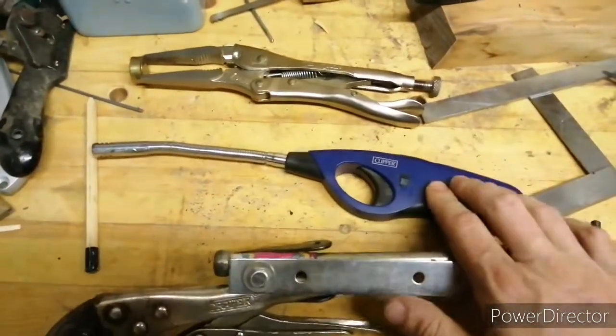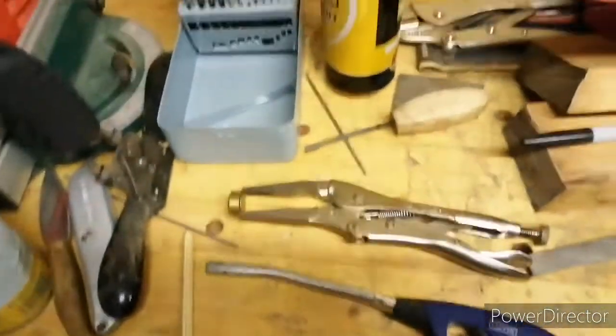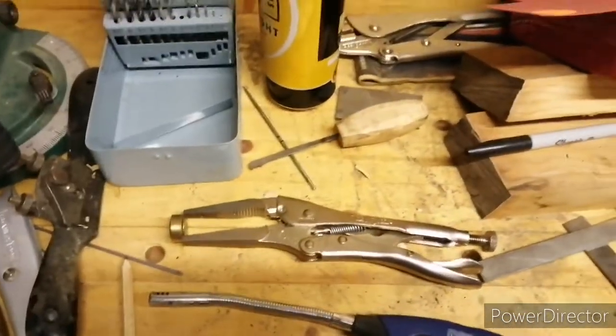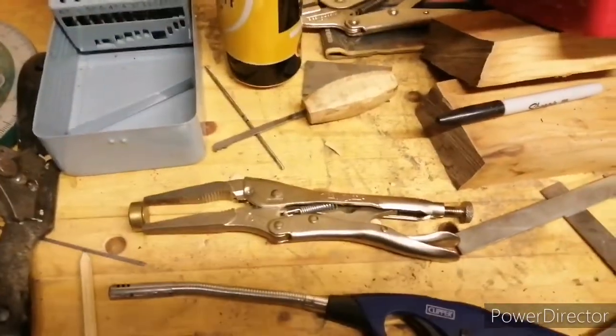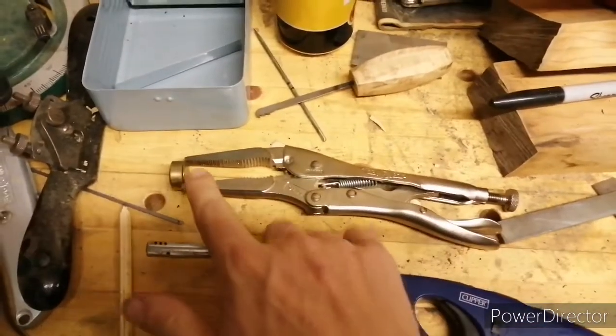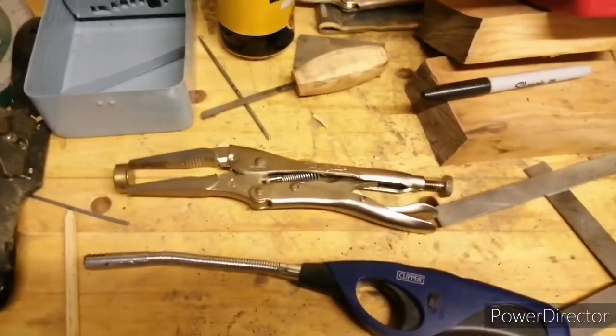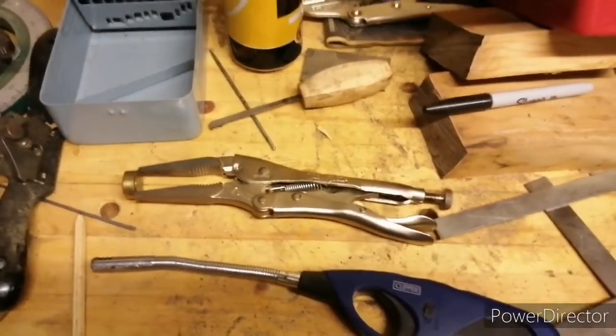We've got this little firelight to light it with, and this is a bit of information I find quite helpful, particularly when I made my first knife. So I've rigged up another little system here. What we've got is a magnet in a mole grip, so we're going to use that for testing when the knife is ready to be quenched.